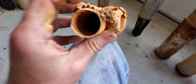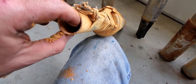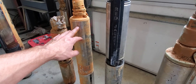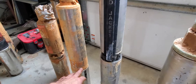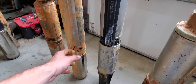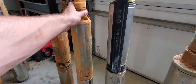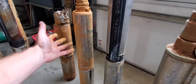Look at this pipe — you can see all that iron buildup. All that mineral and grit passes through the inside impellers of the pump. The impellers on most pumps are made out of plastic or nylon, with a metal outer casing. If the pump services a million gallons over its lifetime and you're sending sand or grit through, the impellers will wear out and the tolerances will wear away, reducing its ability to build pressure.